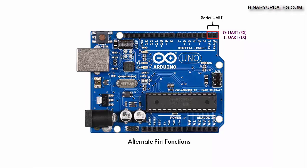You'll also see that analog pins A4 and A5 can act as I2C pins. A5 can be used as SCL (Serial Clock Line) and A4 as SDA (Serial Data Line). The I2C protocol is very important because many sensors and memory chips use it. With I2C you can interface EEPROM, gyroscopes, RTC clocks, and many many other devices — it's a very powerful and important protocol in electronics.